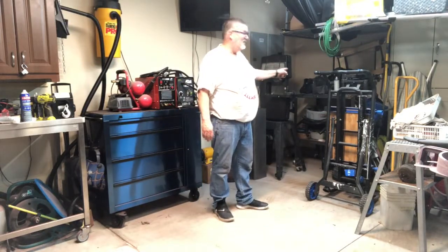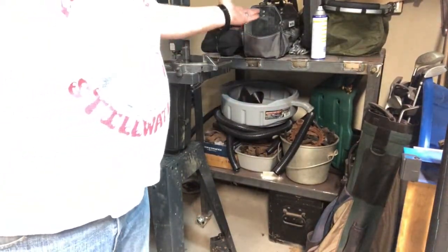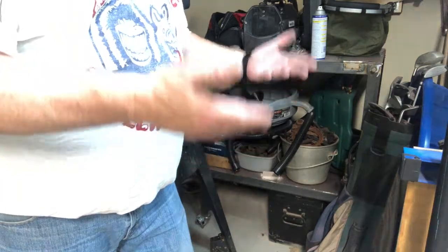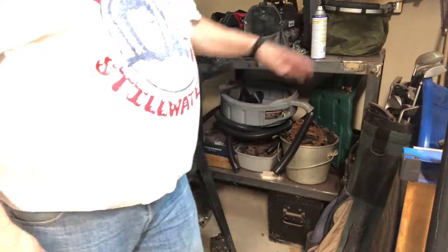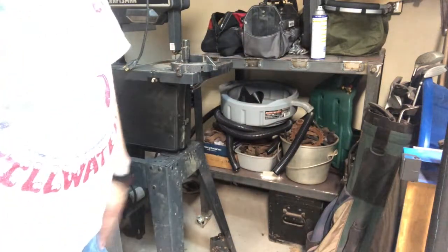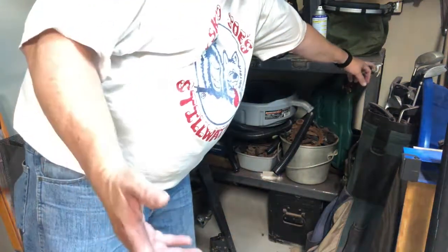But back here is a plasma cutting table that I built myself after I finished going to welding school. It has a little shelf at the bottom, has grounding spots on there to ground your plasma cutter, and these hinges. Right now there's 16 gauge steel on top, and what those do is those will flip out, and then you have the slats on top of the table that you can plasma cut on. On top here, I'll use that to do TIG welding. I'll be sitting up there, because basically once I ground here, I ground to the whole table.